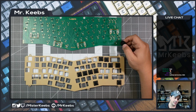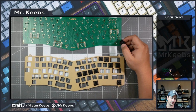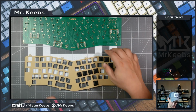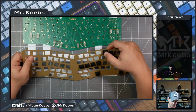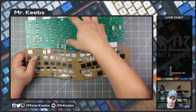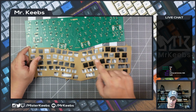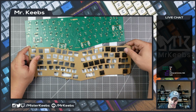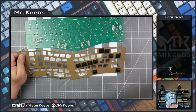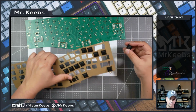So I built this Alice yesterday, and I didn't like the way it sounded or felt. So as I was saying, we're rebuilding it today. But today I'm gonna use a different strategy. Instead of trying to solder some of the switches here, some of the switches there, and then go from outside in, we're actually gonna put all the switches into the plate, and then we're gonna solder them after the fact, because this plate, I learned, is really, really tight. So the switches were not being pushed in all the way.